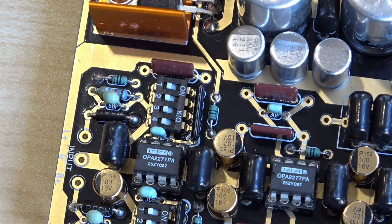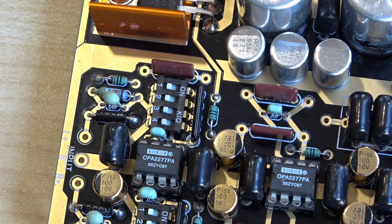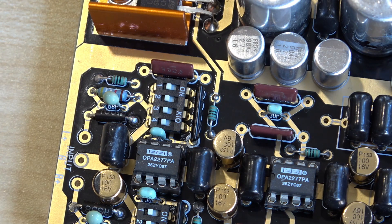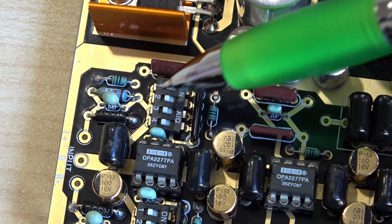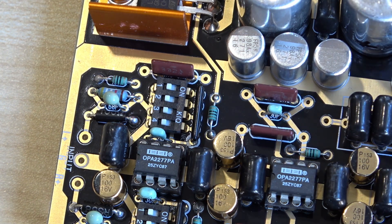Earlier I showed you this component and I wasn't sure exactly what it was, because as usual there are absolutely no circuit details given. I had to measure it — I thought it might be an array of capacitors, resistors, or even a chip of some sort, because if you look up the part number it comes up as an integrated circuit, multiple capacitors, and multiple resistors. But its location next to these switches should be a giveaway — the answer is it's resistors, very close tolerance resistors. You select whichever switch you want to connect, and it's in the feedback loop, so it provides adjustment to the gain.